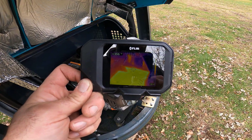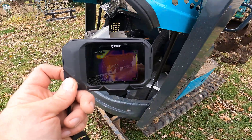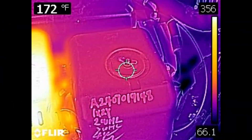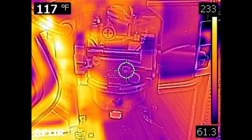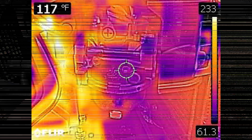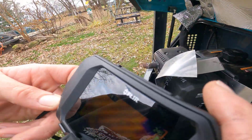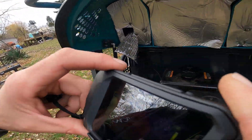That's saying 350 right there. Let's take a shot of the air filter - carburetor housing is 160 degrees. The carburetor itself is 118 degrees. So we must have some evaporative cooling from the gasoline going in there. Let's take that shroud out - that's too hot anyway.